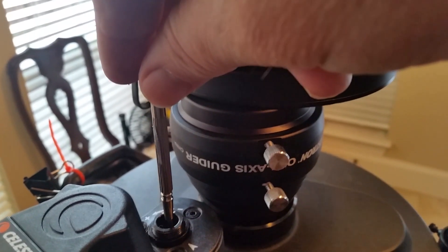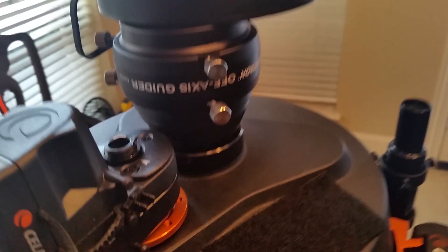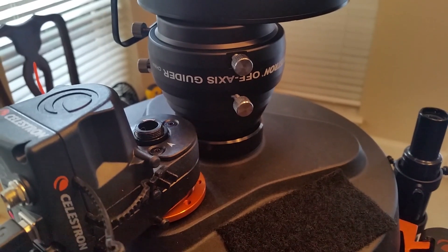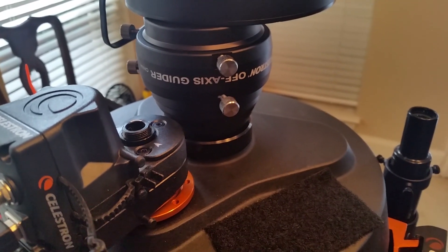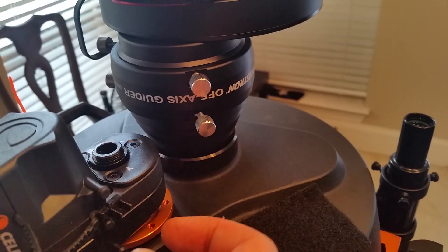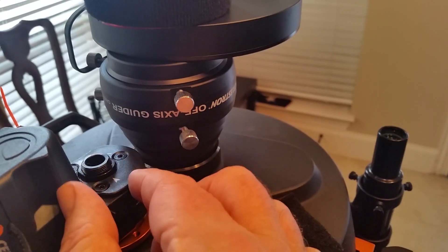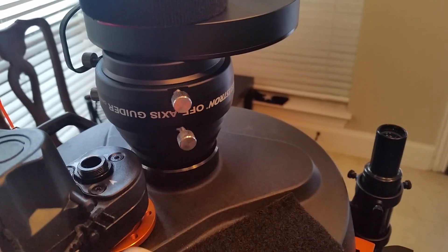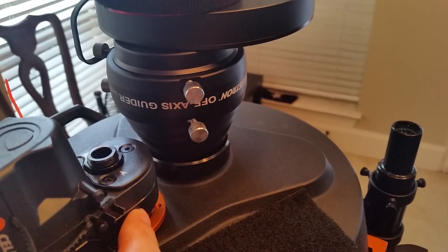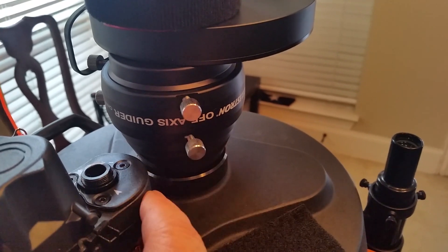If the motor is operating and turning, and the outside of the focuser is moving, then this screw should rotate as well. This is on the pivot here, so it should simply rotate underneath me. However, the motor is not turning — so either there's some binding inside the shaft, or there's just a problem with the focus motor itself. I'm going to have to try to disengage the plastic sleeve that grips the OTA focuser shaft and the inner surface of the motor. There's a set screw that clamps that plastic piece onto the shaft, and another set screw that connects the focus motor to the plastic part.